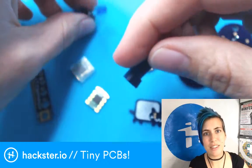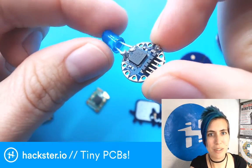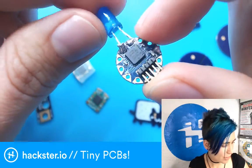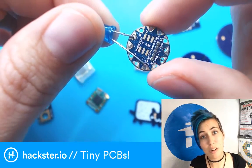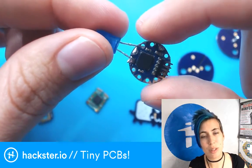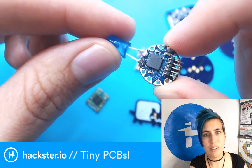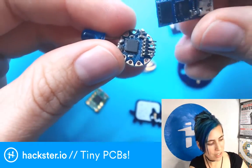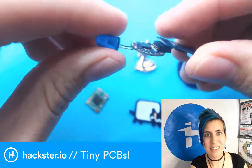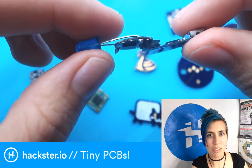Next up, we have actual Tiny Circuits. These ones actually have the name Tiny Circuits. This is an Arduino — I think it's equivalent to an Arduino Leonardo. It has all these little broken-out pins. I talk about this one a lot because I really love it for wearables — it's sewable and washable, and as long as you remove the battery, you can sew this into whatever. I also like making little jewelry things with it. If you want something you can wear as an earring or whatever but don't want a lot of space or weight, this is perfect. The programming is sort of detached — you get this kind of starship enterprise attachment with a little disc and programmer. Micro USB over here, and again these are half-height PCBs, so they're very thin and light.